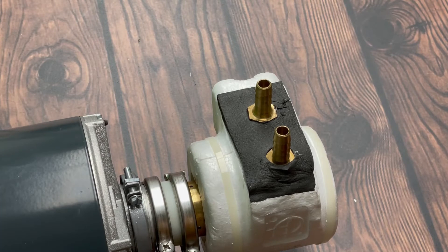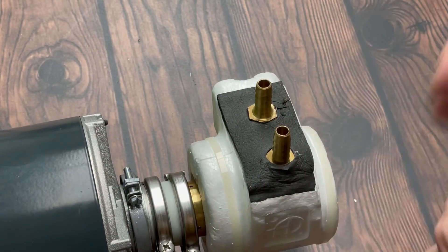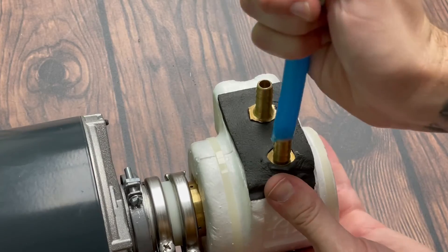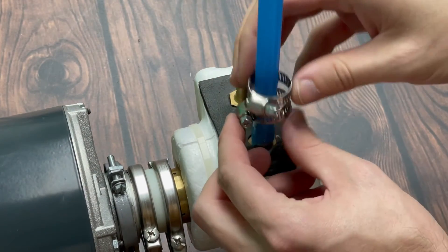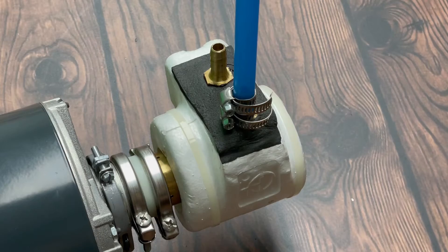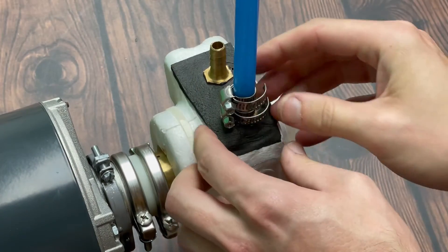Now we just need to reattach our glycol lines with the screw clamps. The sending line goes from the pump into our trunk line. We had some of it torn off, so you might adjust the trunk line or scoot the entire glycol chiller a little closer. Take two screw clamps, force them down pretty much to cover the entire barb, then tighten your screw clamps extra tight. I really want to emphasize getting these screw clamps nice and tight.